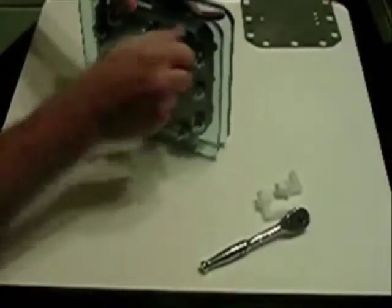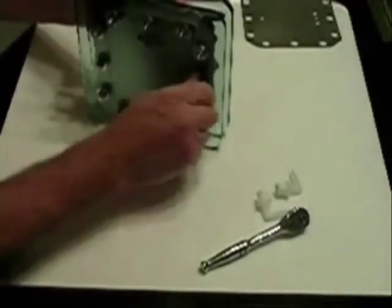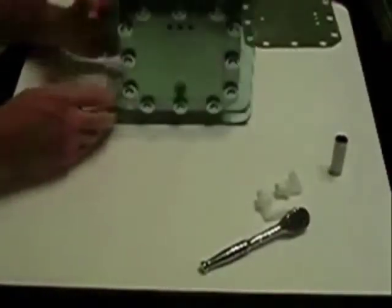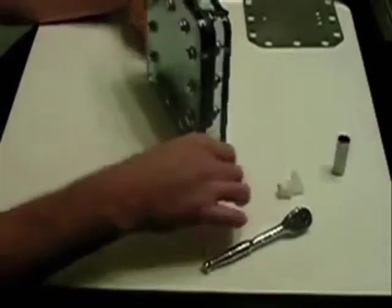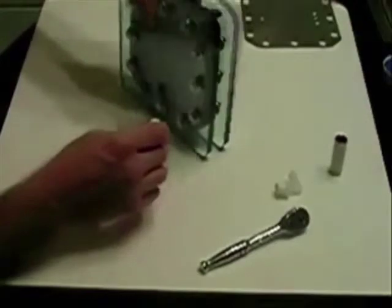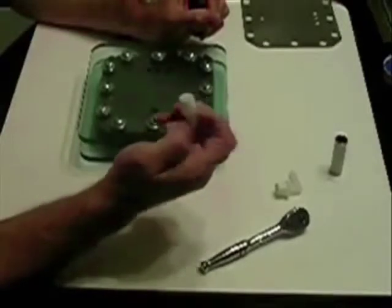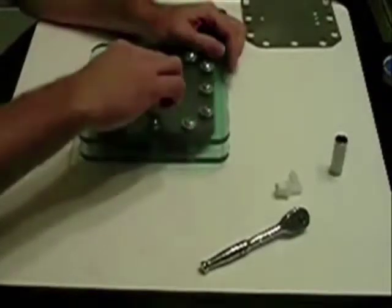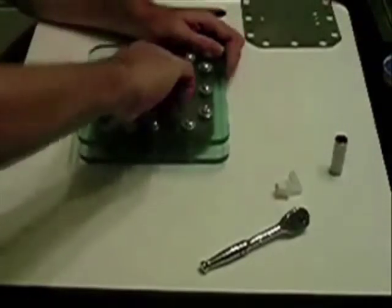And as you go back, you're starting to notice that you can turn some of them because of the way you've tightened them. Just double check everything. There is the cell part of it. And I've already taken the liberty of putting Teflon tape on these, as I said earlier. And for these particular fittings, I think it's 1/2 inch. Anyway, that's what that was, and I tapped it out, and they should go on in there, no problem really. Line up very well.